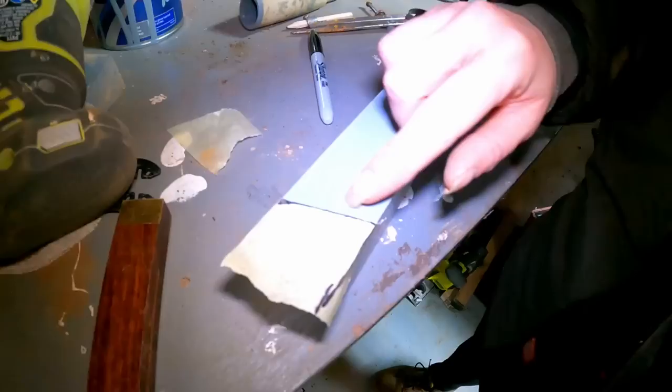Well done. So just to point out, this is basically just a superficial part, because we've already put a sister in, but obviously I didn't want to fill a massive big hole, so we've cut it out and we're going to inlay this piece that Gemma's making now. And then it'll look pretty and it'll also work on compression, won't it? So if your bow's trying to be higher than the stern, then it'll help for compression. So, all good.